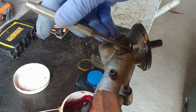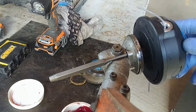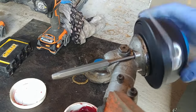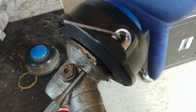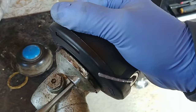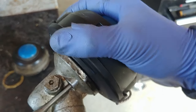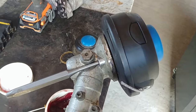Now it's time to put the cutting head on. To tie it, we need to spin the head counter-clockwise. Do a little bit more — make sure it's tight, but you don't want to strip it since it's plastic. Just go by feeling. Make sure it's not going any further, then stop. It won't go anywhere because it will be spinning clockwise during use.